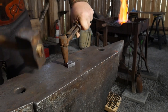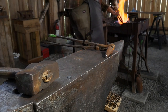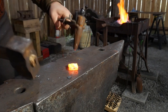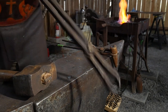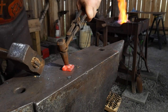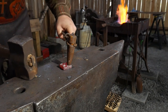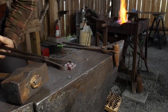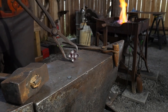For this first stage, we're looking to basically have things laid out and we're going to deepen everything on the next heat. In the next heat we're going to deepen things, and you'll see me tilt the punch more outward - this gives the individual petals of the rosette a lot more flair. Pro tip there: some of you may ask why not put it in a vice? We need this material to flow out into negative space so you get a nice bulgy, petal-like look. If you trapped it in a vice you'd get a lot of marring and it won't hold well. Give it a good brushing after forging to clean it up and make sure you don't have any bad hammer marks.